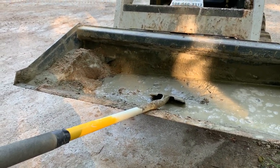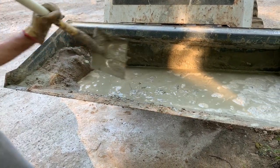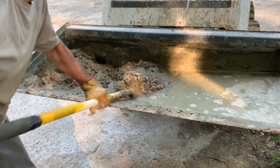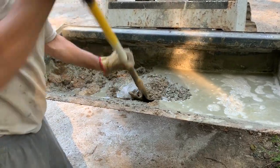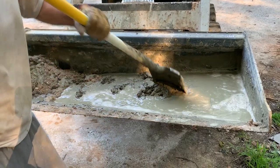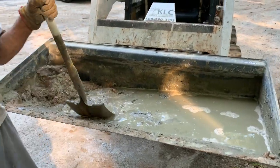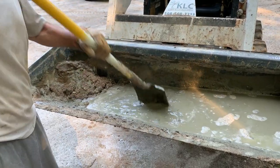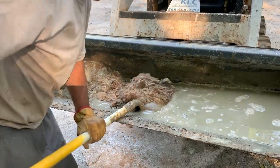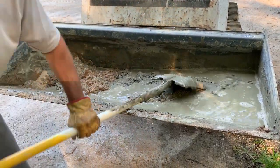Now I know I'm going to need a little bit more water, only because I've been doing this. So there you have it. That's the amount of water I'm going to use. And that's the beautiful thing about mixing your sand and Portland first, is you can mix it a little bit wetter. And then the stone turns in, but you know that your cement is mixed with the sand and water. I mean, it may not be 1,000%, but it certainly isn't too bad.